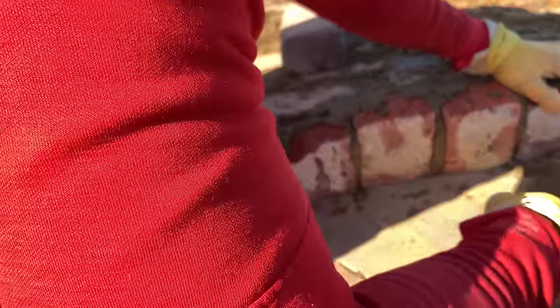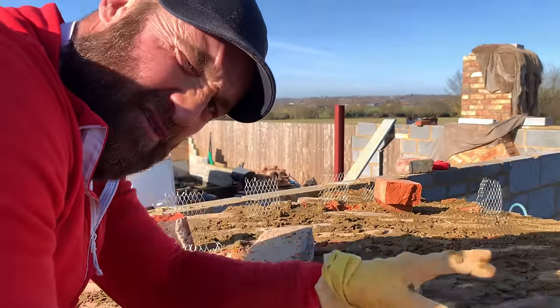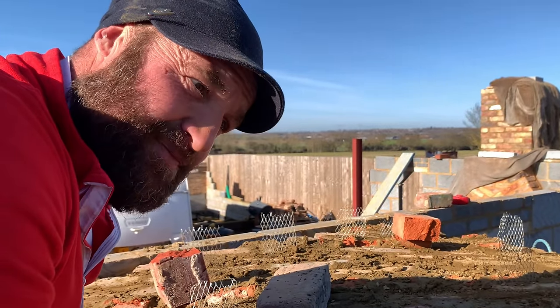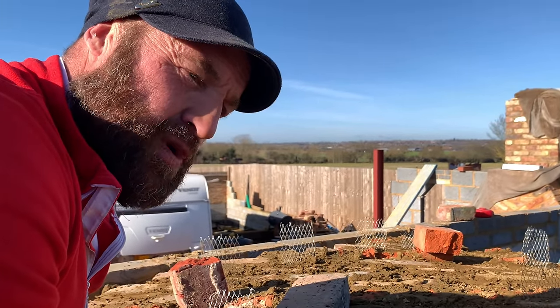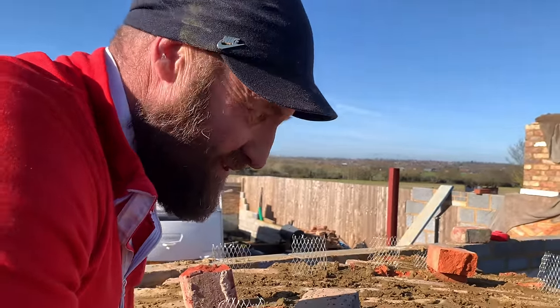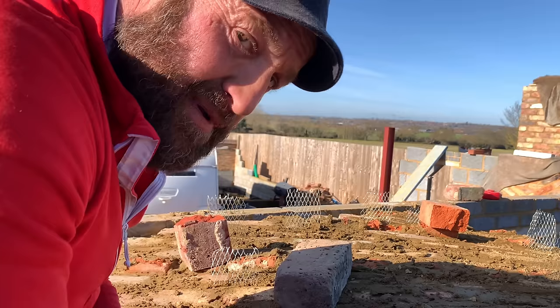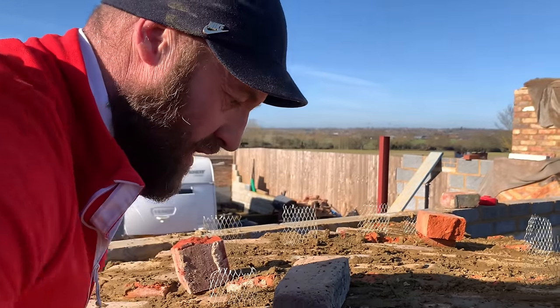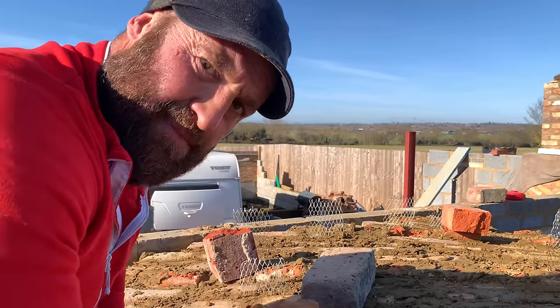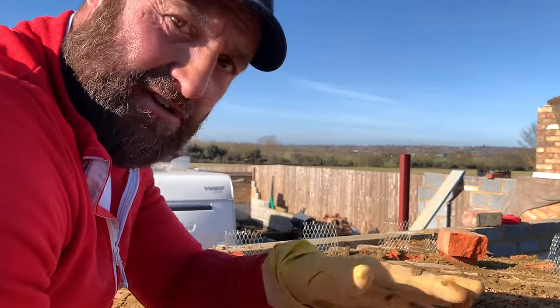You never know doing it like this because the underside performs. So what we're doing is we're laying face side to the eye here. It's like when you build a 4-inch wall and face up both sides. The face side is the side you're working, so the discrepancy is the other side. So with this, you're splitting your inconsistencies. If you've got a rocker, you split it both sides. Otherwise, this would be lovely and the other side would be gaping and grinning everywhere.